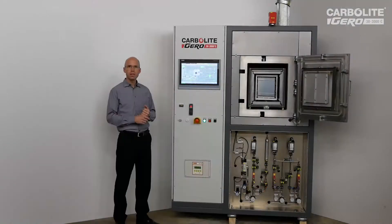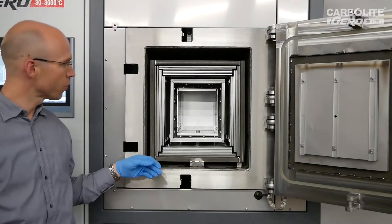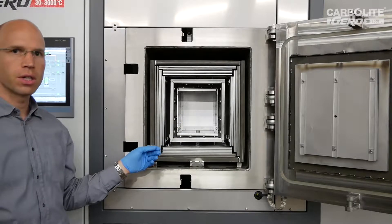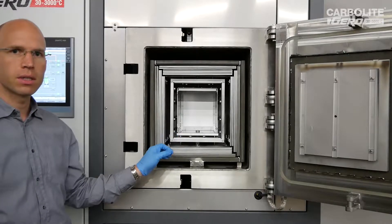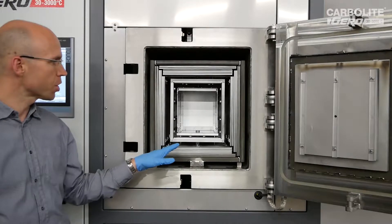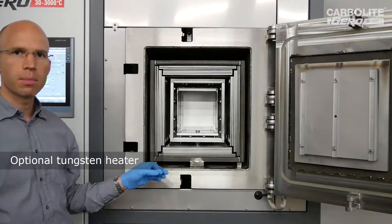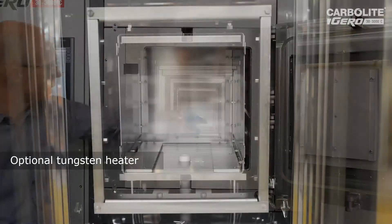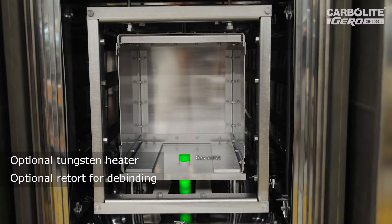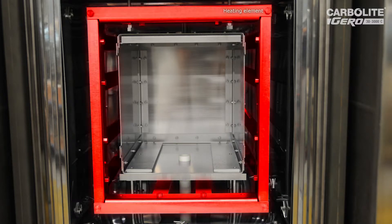I will show you some details of the interior of the heating cassette. Inside the heating cassette of the HDK 8 — this is a furnace for research and development — they want maximum flexibility about temperature. Usually molybdenum furnaces are tailored for 1600 degree C operation, but to increase the stability of the heating element we included a tungsten heater here. The customer benefits from a long lifetime furnace even during a debinding procedure. Inside the retort you can see the central gas outlet. The only way for the binder to escape out of the furnace is through this central gas outlet, which protects the water-cooled wall as well as the heating element and insulation elements.